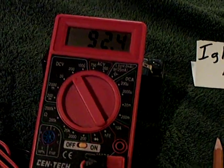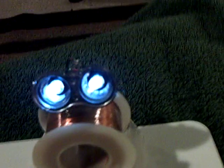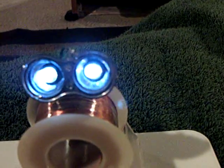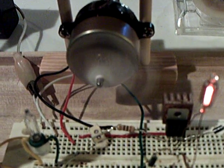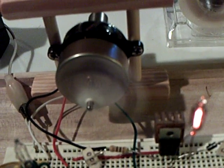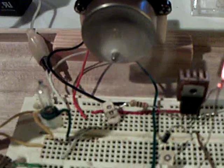Now what I can do is take that and put it into another battery, and now I've got that Bedini charging scenario that we've all played with - those of us that have worked with the Bedini SSGs. I just want to share that here's another little motor idea: not only use a motor for a generator, but also by putting that neodymium magnet on the back of that motor, now I've got the generator part running remotely. This is running on 6 volts; it's 50 milliamps. At 12 volts this thing just flies - it's scary fast - but the amp draw goes up to about 120 milliamps, similar to a standard Bedini SSG.